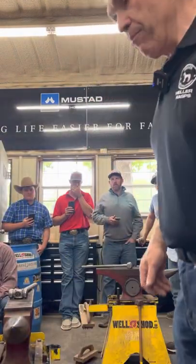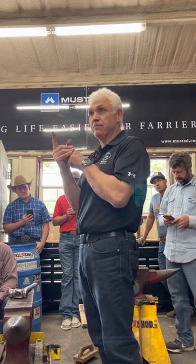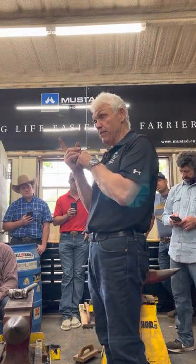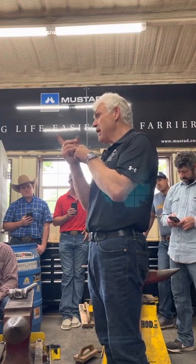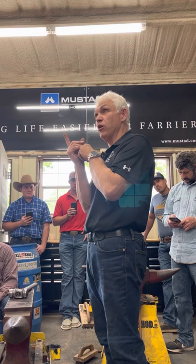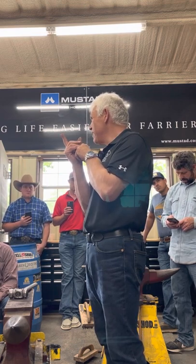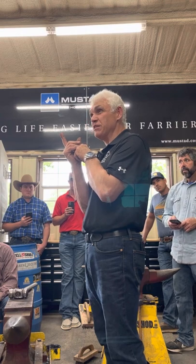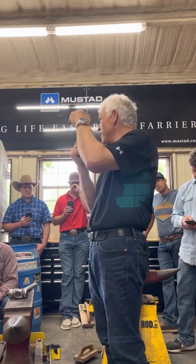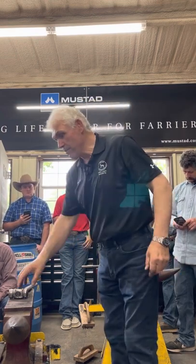So we're going to bend our toe. We're going to bend our heel to 45 degrees. That's about what the transition from the heel quarter to the bar is, about 45 degrees. Then what we've bent over, we're going to hockey stick back in about one third. One third's a proportion, not a number. Because it's a proportion, it doesn't matter whether it's a big bar shoe with a big piece or a little bar shoe with a little piece, you drive it back in about one third. Get it back in proportion.